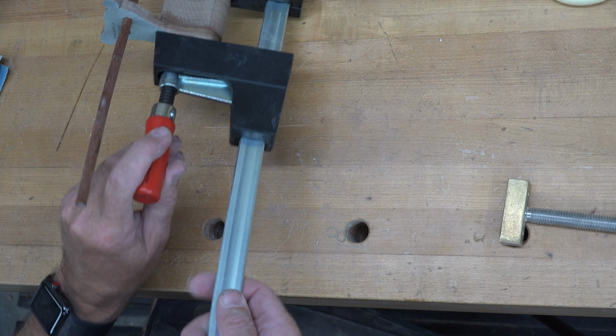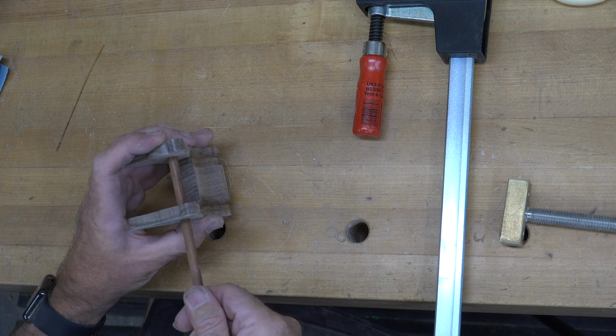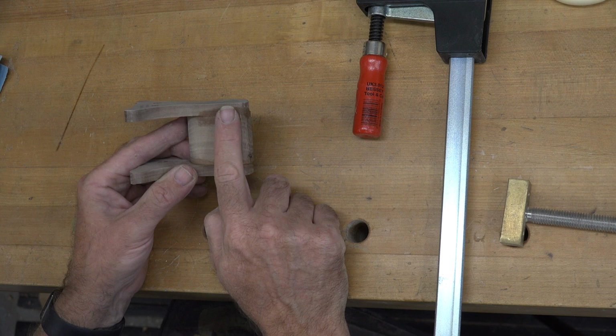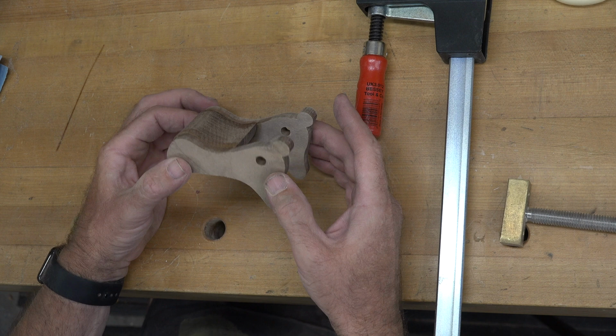And at this point, after all of that, our hippo's head is dry. So I'm going to take this over to some sanders. On convex curves, these outer convex curves, I will use a belt or disc sander. On the concave curves or the inner curves, I'm going to use my oscillating drum. So you want to sand this up so that all of these surfaces are smooth, and we get a really nice transition here and a really nice even surface across the hippo's mouth.